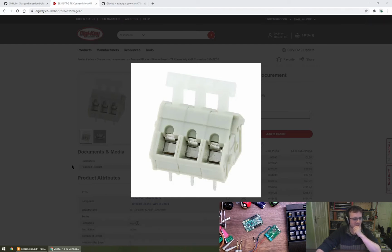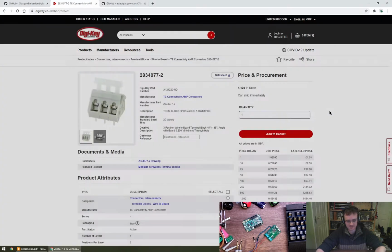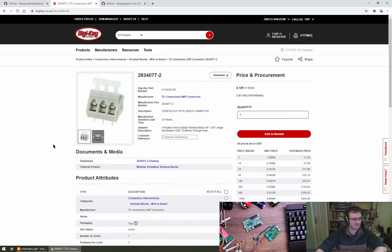Yeah, 120 ohms at each end, which gives you an equivalent of 60 ohm total. So, you know, on a fully compliant bus, I think you'd see effectively a 60 ohm termination. Okay, I've forgotten about 100 ohm low speed. If everyone's okay, I think we're going to go for 120 ohm termination on board, and just go from there. If it works out to be wrong, then we can figure something else out.